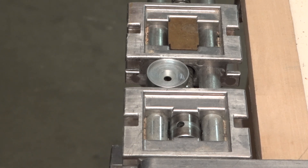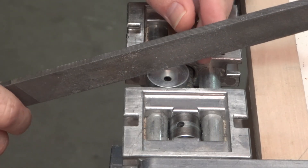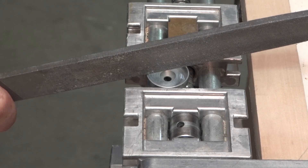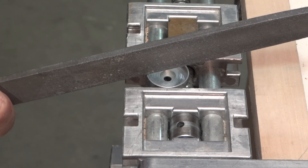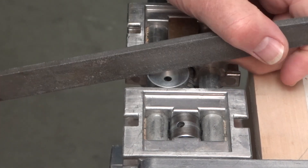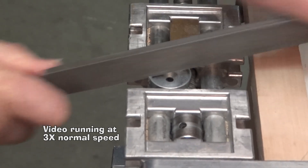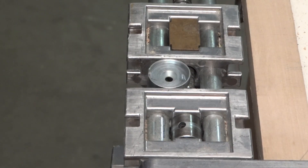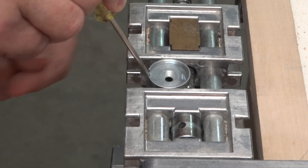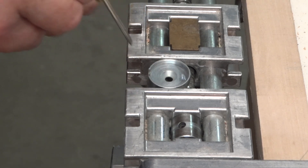Here's a little tip for you: if you decide to use one of these cups to put a magnet into, put a notch on the edge of it with a file. When you've got a notch there, if you decide for some reason you want to remove the magnet, you can pop it out with a small screwdriver. If you don't have a notch there, good luck — they're difficult if not impossible to get out. With that notch there, you'll be able to put a small screwdriver between the magnet and the wall of the wood that the cup is set into.